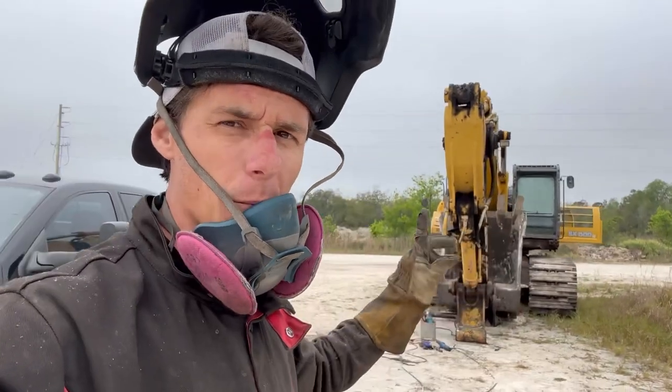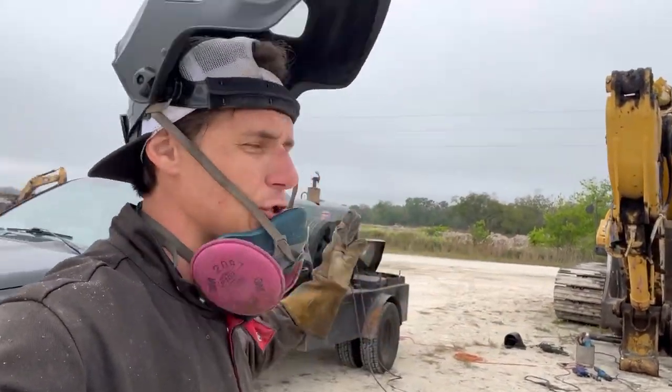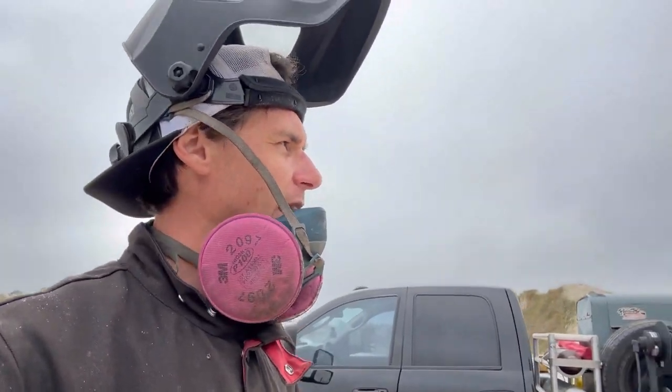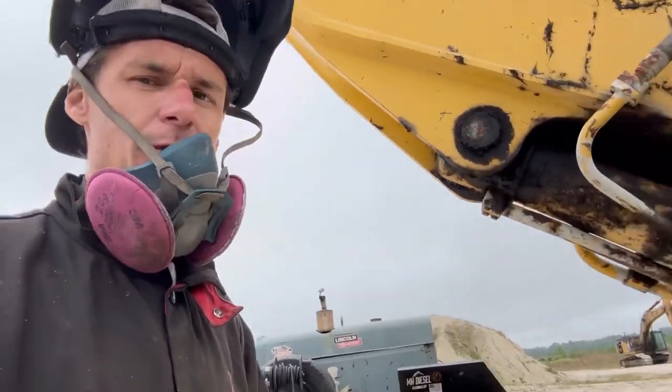Turkeys. Here on site, I'm working on this old excavator. Let me show you what they did to it and where I'm at, because I started this the other day. I didn't get to film the other day — my phone was overheating — but today it looks like the weather is going to be a little cooler. You'll see it's overcast. So let me show you what's up.